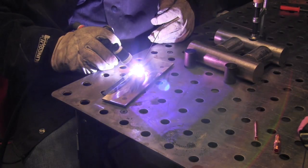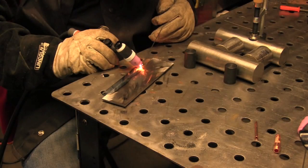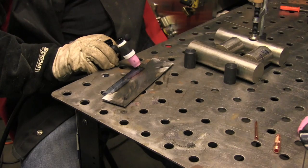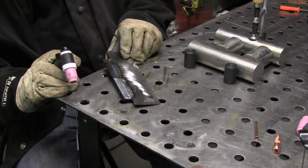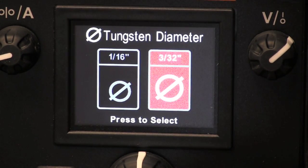Let's run this lap joint here. Cold rolled steel, cleaned up, wiped down, cleaned off with a sanding disc. We're keeping a tight arc, and I'm working around the camera so I am doing a little bit of shaking, but you get the drift. Terminating the arc, I see this torch has a valve switch on it. There's no solenoid timer post flow on the machine — although I don't really understand why there isn't, because there's obviously a solenoid valve in the machine for MIG welding. In this setup, you use the valve on the torch.